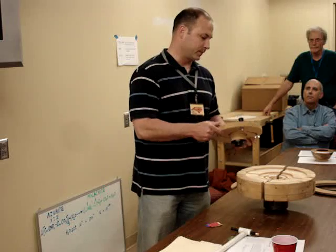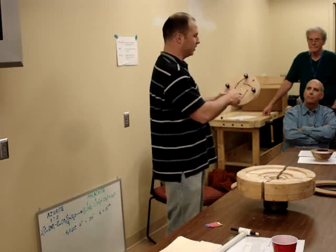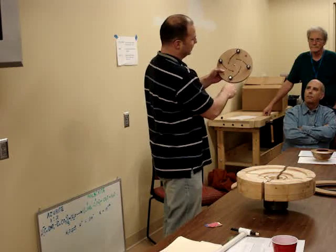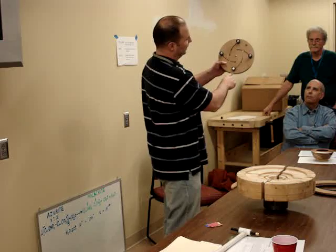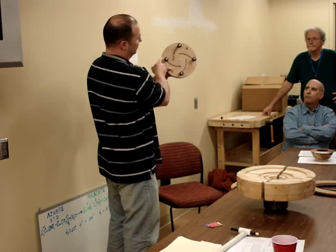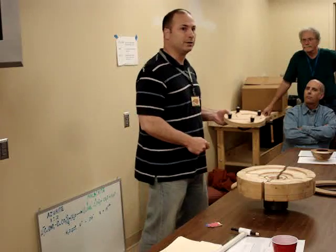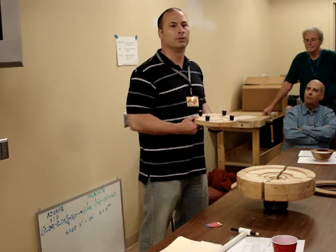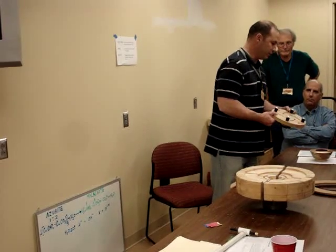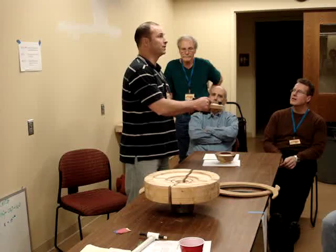Quarter-inch plywood with a piece of MDF on the back. With a router — I made a circle-making base. What I did was make a cross, drew two circles, and where the outside circle met the cross I used that as a pivot point. The rubber stoppers come out of the hardware section at Lowe's — I think I paid 70-some cents for the bottle stoppers.